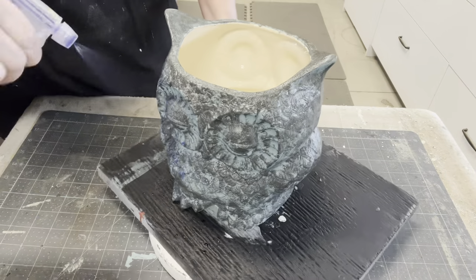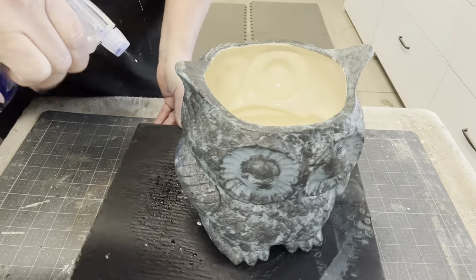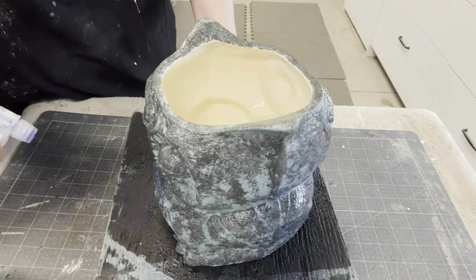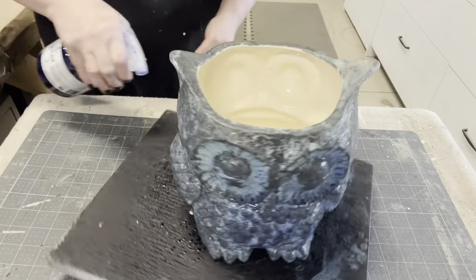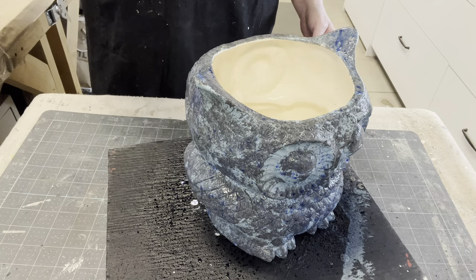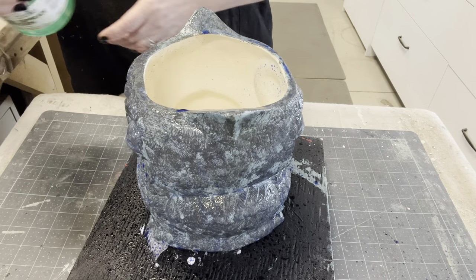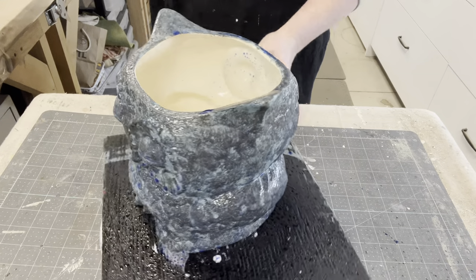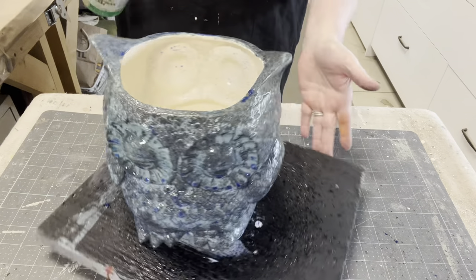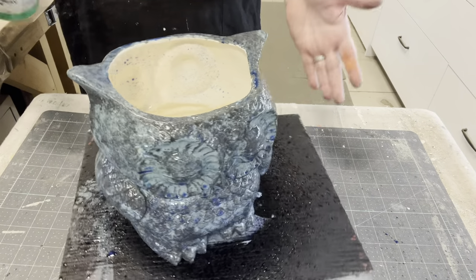Here's the patina I was talking about — it is the blue patina spray by Dixie Belle, and it goes along with their paint. I'm hoping for some turquoisey color, but I don't necessarily want the whole thing to be turquoise because I don't want it to match the heirloom paint completely. So I'm going to go ahead and mist this on first. Then I like the variation of color, so I'm going to mist the green patina spray right on top of that turquoise. My paint is wet, my sprays are wet, and then you just let it sit off to the side and have that chemical reaction. I'm not worried about the overspray on the inside because I'll be able to wipe it out.